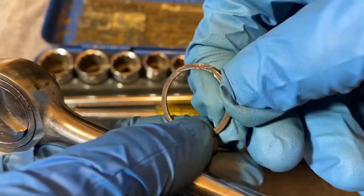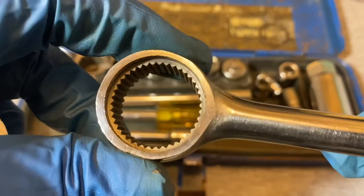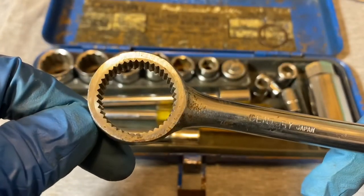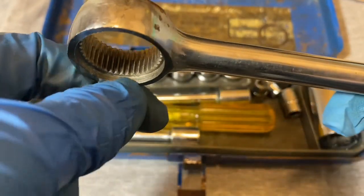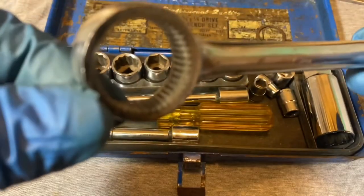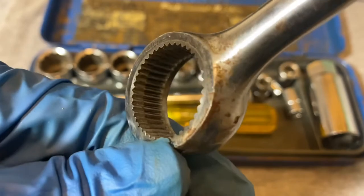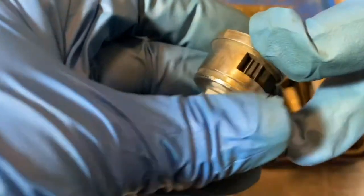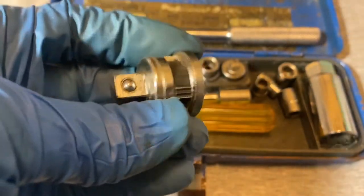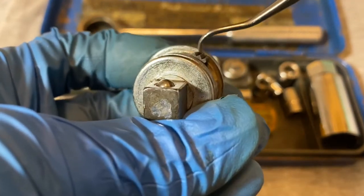Here's a look at the head. There's some rusting but it looks pretty well centered — not a bad job at broaching this part. There is a lip cut out here, and there are 41 teeth. This looks like it hasn't had much use because the teeth look pristine — pretty sharp, pretty well done all around. Here's the mechanism — this is where it gets not too great. It's a usual SK-type mechanism with a teetering pawl, and this one has three teeth per side.